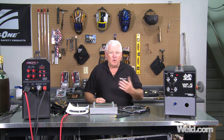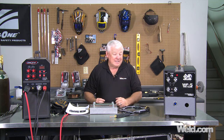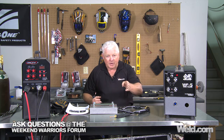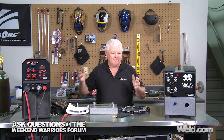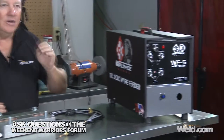There are so many different ways of doing it. We're going to do a series, part one, through probably about ten different parts. But I want to start off with the basics behind all this and why you would even do it. You've watched as I hold a TIG torch and show you the right angle and introduce the filler material. Well, what if you get some production runs or long runs and you get tired? Hand-feeding TIG filler material, you can only go so far before you have to grab another wire. So what I'm going to do is give you an introduction to a wire feeder, a hand wire feeder.